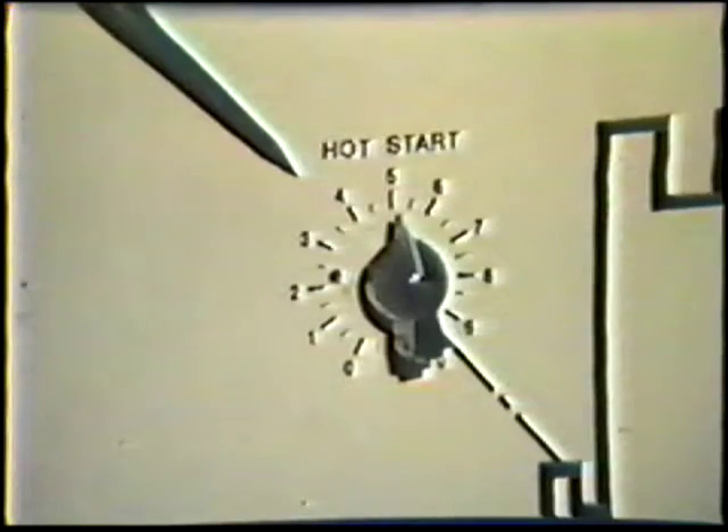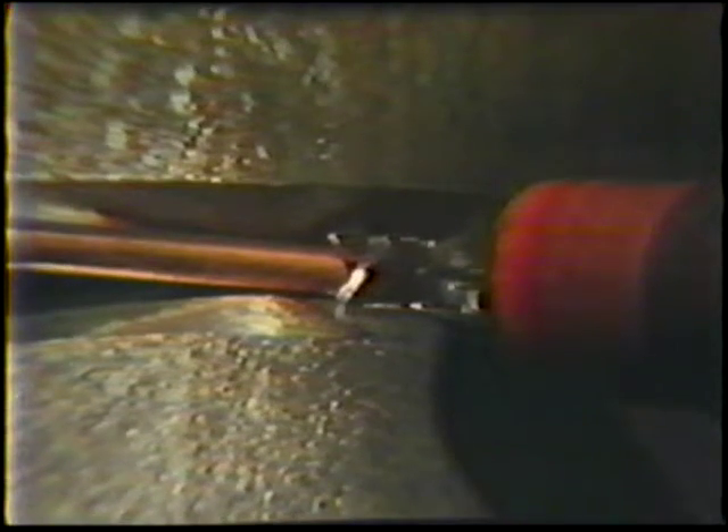The hot start is sometimes used in order to aid in starting the arc. Following equipment setup and workpiece positioning, the process of welding begins. The scratch start method is normally used to start the arc on pipe. To do this, the tungsten point is scratched lightly against the work and then quickly pulled away to the desired arc length. This is similar to striking a covered electrode.